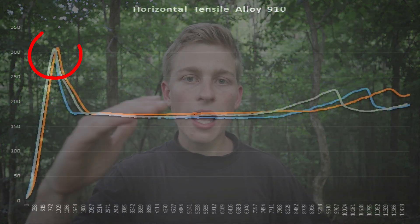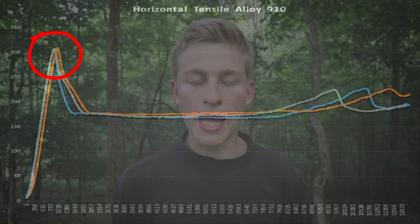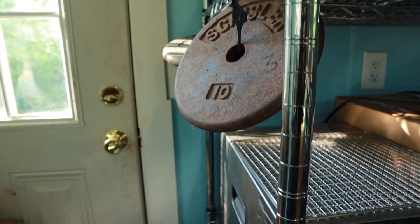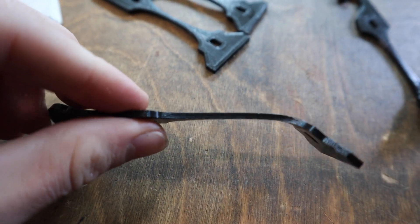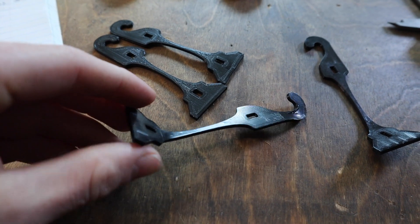What we're going to be talking about today is the yield point — where the plastic goes from being elastic and everything's good to actually irreversible damage. That yield point is the important number when you're looking at tensile strengths for plastic. For Taulman Alloy 910, it's about 8,000 to 10,000 PSI depending on moisture conditioning. What creep is, is when you are loading the plastic with stress significantly lower than that yield point — an example of significantly lower would be 1,000 pounds per square inch, which is 10 to 12 percent of the actual yield strength. So you should have a huge margin of safety, and you normally do. But what creep is, is at that loading, the plastic very slowly deforms and stretches irreversibly. That is creep.